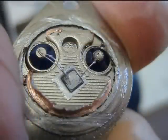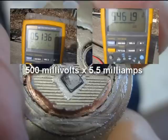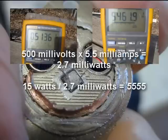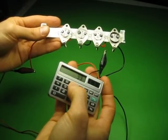These types of solar cells don't give a lot of power. The best I got outdoors was around 500 millivolts and 5.5 milliamps, which works out to 2.7 milliwatts. To power a single 15-watt compact fluorescent light bulb, you'd need over 5,000 of them. But you can power a small desktop calculator, as I'll show in another video.